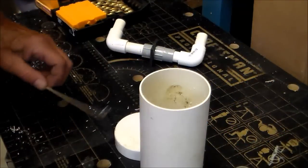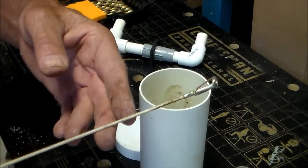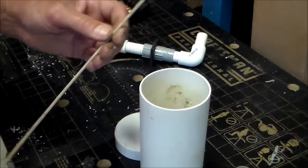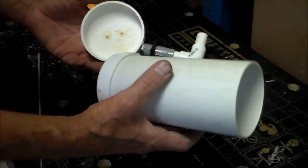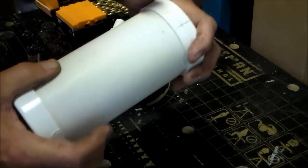The flushing water chamber is going to be fabricated in my shop. Here I'm using a piece of fiberglass rod from a broken fishing rod. The taper on this rod will allow me to slide it into holes that I will drill and drive it in to be a wedged fit so it will lock in real tight.